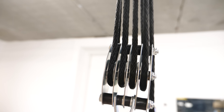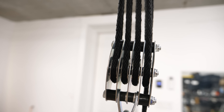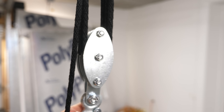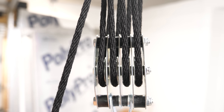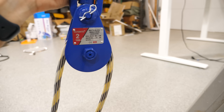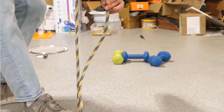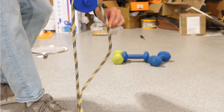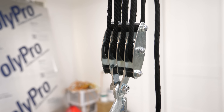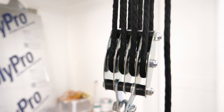But movable pulleys are still not very easy to wrap your head around. Watch the speed of each rope of each individual pulley as I move the rope - notice something odd. Each rope is moving slower than the one next to it. If it's one continuous rope, then how is some rope moving faster than other parts of the same rope? The confusion comes from the fact that the bottom set of pulleys is moving as we move the rope, and that changes everything. With a fixed pulley, the rope moves at the same speed on both sides. But if we fix the rope and let the pulley move, one side is fixed and the other is moving. So the speed of the rope on one side equals the speed on the other side minus the speed of the pulley. For each pulley the rope goes around, we subtract the speed of the pulley moving up, so the rope speed gets slower and slower until at the very last pulley it's not moving at all.